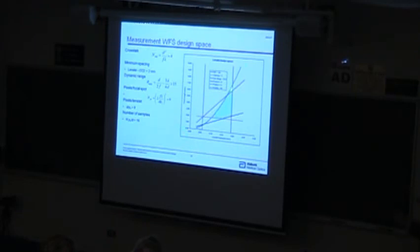That curve of the constant Fresnel number is this curve here. Everything needs to be below that. This is focal length here and lenslet diameter here. There's some practical limit. I can't get the lenslet any closer than about 2 millimeters from the detector, just mechanically. There are some limits. I need at least a certain number of lenslets on one end, and I need a certain number of pixels across the lenslet on the other end. So there are limits on the diameter both ways.